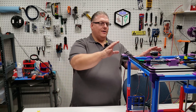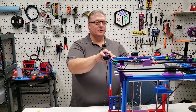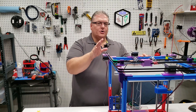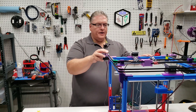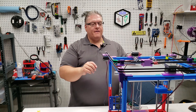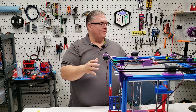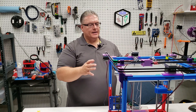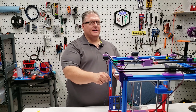Overall I think this project is coming along quite well. As part of a plastic structure versus an aluminum structure, there is a little bit of wiggle in here. So it works great for prototyping, or if you had a project where you didn't have to worry about a little bit of wiggle or play. But all things considered I'm rocking this a fair amount and it is very structurally strong. When I put linear rails on here, they actually tightened up the frame, and the corner pieces really tighten it up as well. As a prototyping tool or a tool for a small project for kids and educators, I definitely think this is a viable solution.